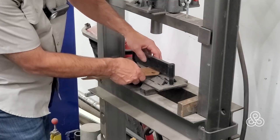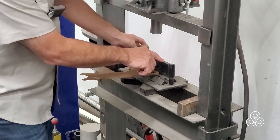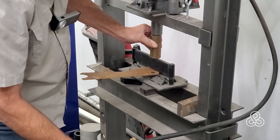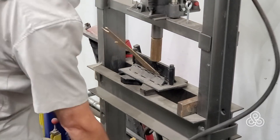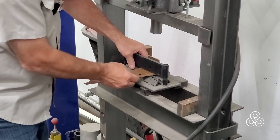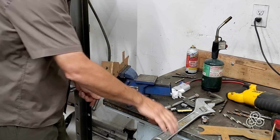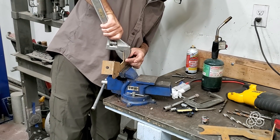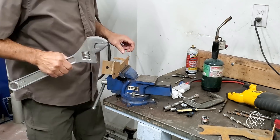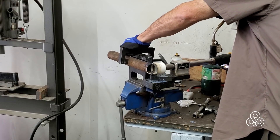Now to do this brace, we're going to have to create a couple of brackets at each end to hold it. At the subframe level, we've got these waterjet cut plates that are going to be welded to a steel tube to attach to two different points on the subframe. I'm taking them out with the press and putting some 90-degree bends in. These bends are going to hold some bolts that will have some sheet metal for the rear crash section bolted to it. One of those tabs I couldn't fit in — don't have a finger brake — so doing it with a crescent wrench.